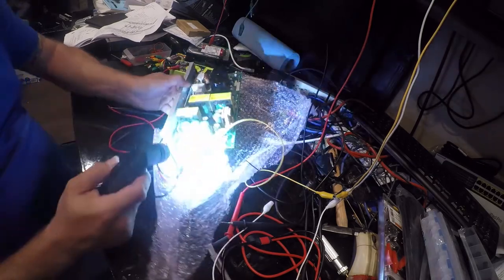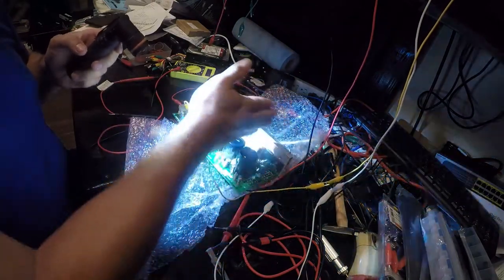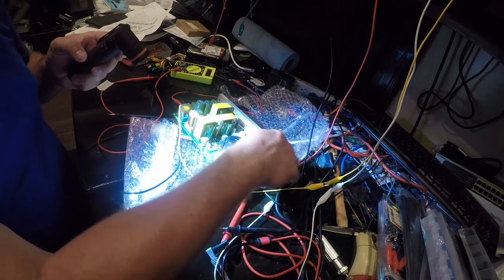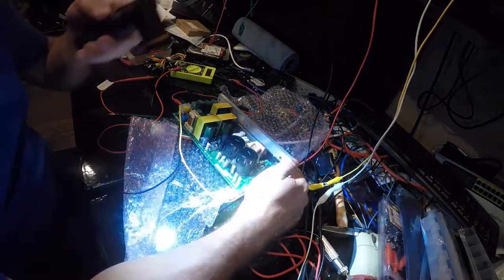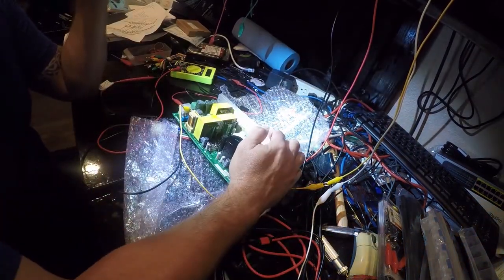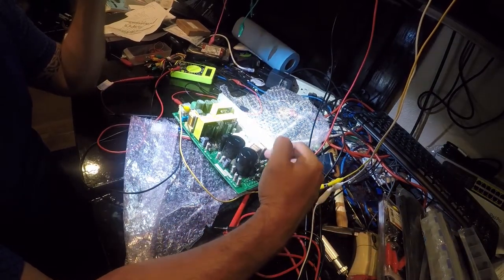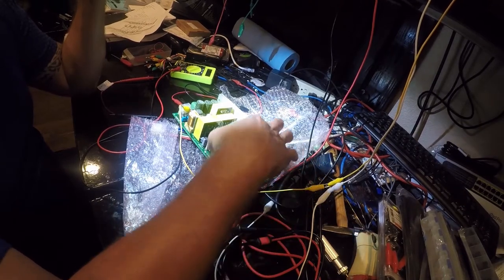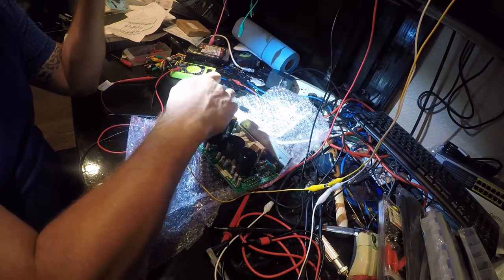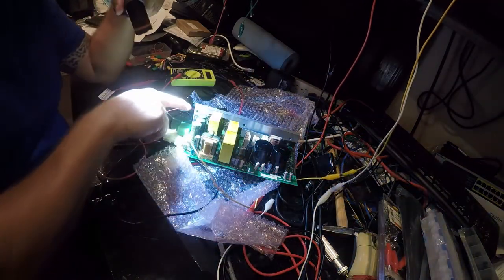I think what we've got going on here is kind of an interesting design with a high voltage input, and then these stabilize the voltage for these rectifiers. Normally you would step this down to DC voltage and then peel your DC voltage off and step it down to what you need. At least that's how I would design it. And what these guys have chosen to do is, this is a very modular looking design, and it's almost like there's one product here, another product here, and then three more products kind of bonded here on the output side, and that these capacitors stabilize the switching current.